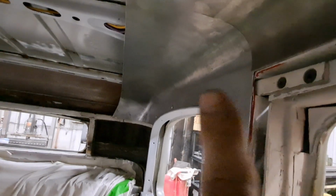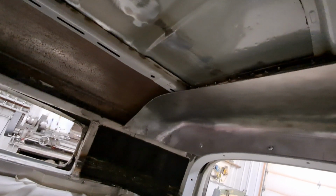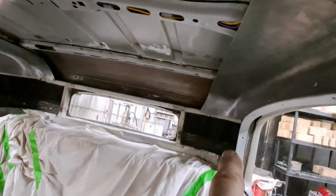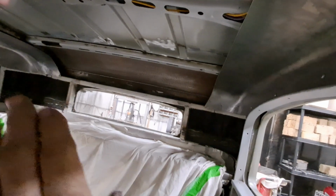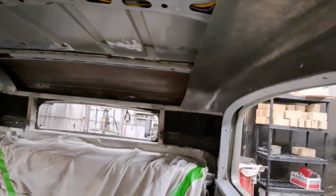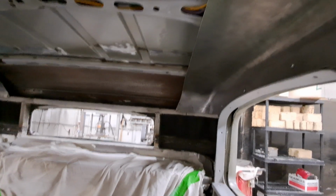That covers down to the interior panel. I still have to make the rear fill piece, but then this travels down, and I formed and wheeled out that radius on each side. So I'm going to jump back on the panels, and I got the headliner, that rear panel, which now goes around the corners flatly, comes in. We'll start to wrap up the interior project.